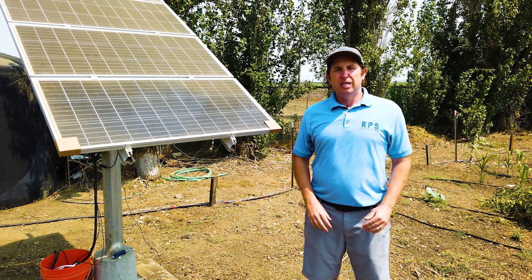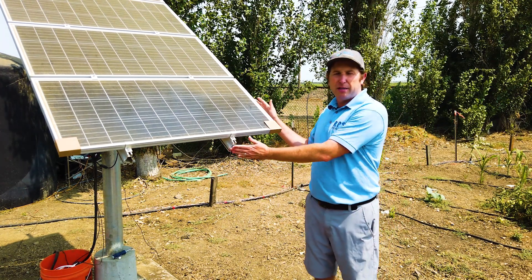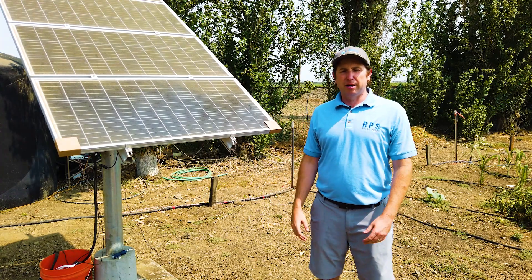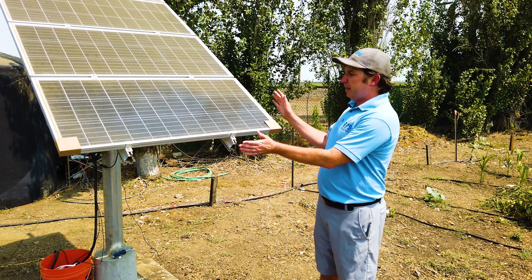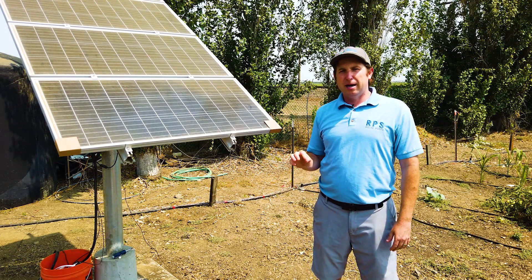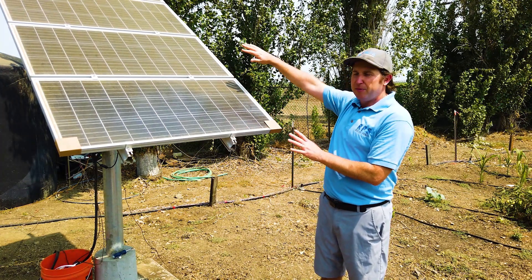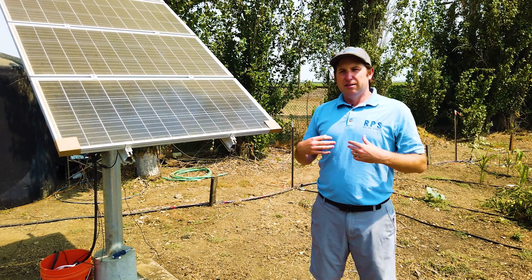We've come over to the other side so we can see our solar panels. If your speed dial is at 10, the next most common reasons for low water production are related to power generation. We need to look at our solar panels and check a couple of things. First, we want to do our testing on a nice clear sunny day without clouds. We also want to make sure our panels are mounted facing south, in the same plane as you see here. With our four-panel top-of-pole mount, all four panels are in the same plane with no obstructions and available for full sun.